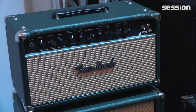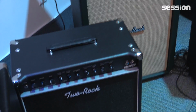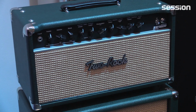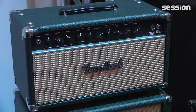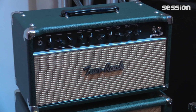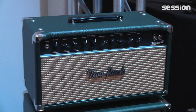I mean, it was something that kind of grew out of our Game Master and 2-channel cascading stage platforms. No reverb on it, and it really morphed into this beautiful cleans and really heavy gain. It does have a full active loop, and it has a cathode follower in the lead channel, like another famous plexiglass amplifier. So it was really weird. It has a cathode follower into another cathode follower, which is a little weird, but it comes out being a really nice high gain amplifier. It's actually also very pretty clean, quiet, low gain. So it's a cool amp. And it rocks. It does rock. It's got a lot of punch.